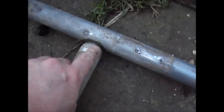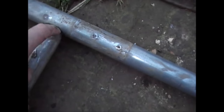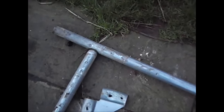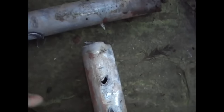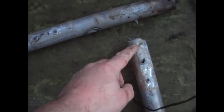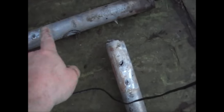There's the joint with the plate taken off - you can see the plate separated. I've chiseled all the welds out. Separating this joint here is going to be almost impossible. If you chisel around there it distorts the pipe a little bit, so what I'm going to do is use an angle grinder to cut through there so I don't distort the pipe. The steel on Heras fencing is quite soft and mild, so it'll chisel easily, but at this point you're much better off with an angle grinder to make a cleaner joint.